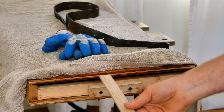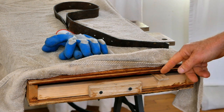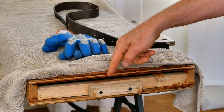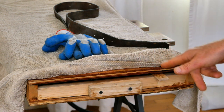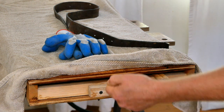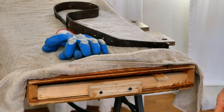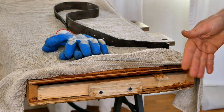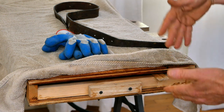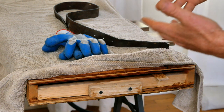According to yesterday's test, these ribs were bending really well at about six minutes. So what I'm going to do is put a rib in, wait a minute and a half, put another rib in, and repeat until I have four ribs stacked. By the time I hit that six-minute mark, the first one will have steamed for six minutes. After that, all I have to do is put a rib in and pull a rib out at each one-and-a-half-minute interval, letting me steam a rib every minute and a half. It's important that your interval matches both the steaming time and your working pace — which is why testing the day before is so critical.